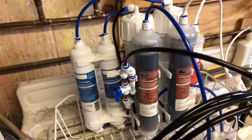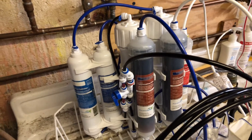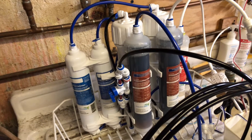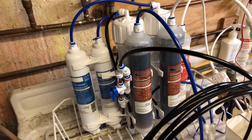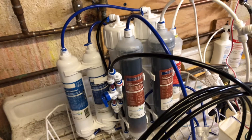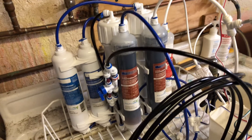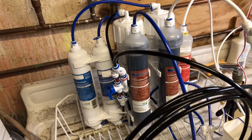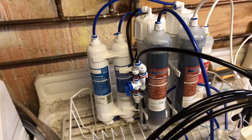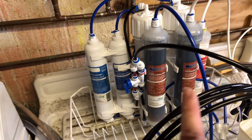The reason why I have two resins: I used to be a reef keeper, and reef keepers care about their water quality a lot — they spend tons of money to get the best water quality. I was watching a video, I think it's BSTV, I'll link their YouTube channel below. They're reef keepers and they mentioned these systems are modular and you can build a custom one any way you want. By putting two DIs, when the first one exhausts, you still have the second one catching it, and then you have time to replace the exhausted one.